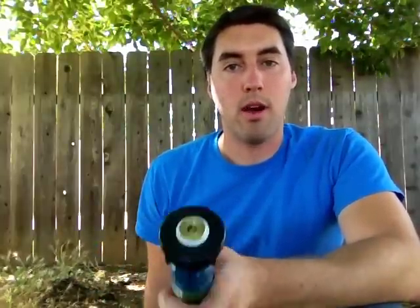But it's a very easy, simple way of taking a clogged sprinkler and getting it back into proper working order. If you have a different sprinkler than this Orbit, it's going to be a similar type of operation — you're going to have to locate the filter and reassemble it so it's spraying in the right pattern again. Almost all sprinklers function the same. Sometimes it might be a bit more complex if the sprinkler has a key to adjust the spray pattern — then you might have to readjust that after you're done. But in general, sprinklers are going to have a filter, a spring, a body, and a little rubber gasket. You just need to disassemble it, clean the filter, clean whatever's clogged, and then reassemble it in like manner.